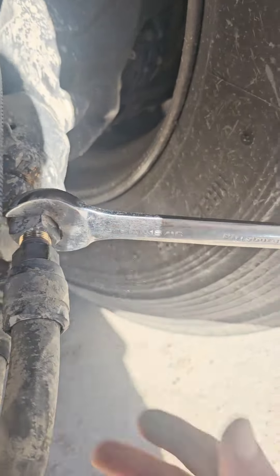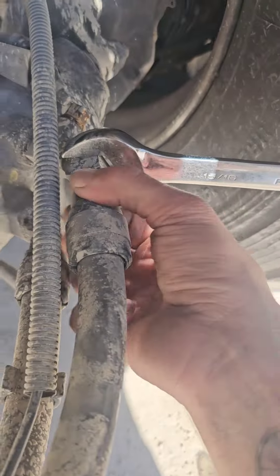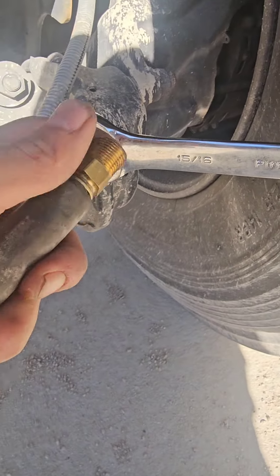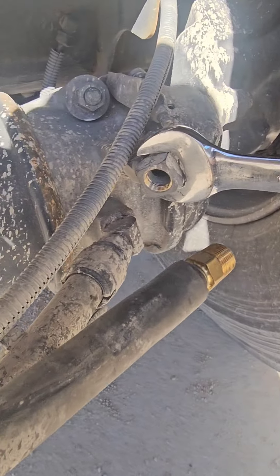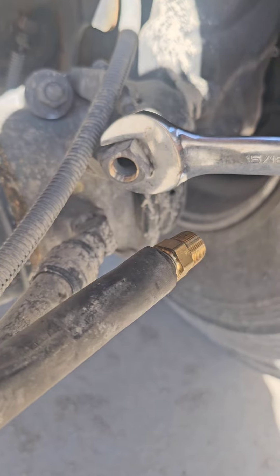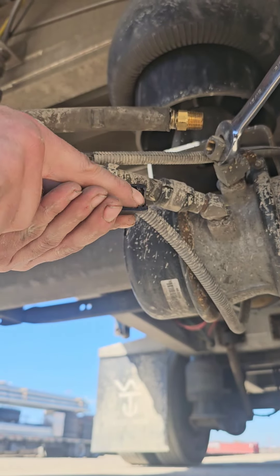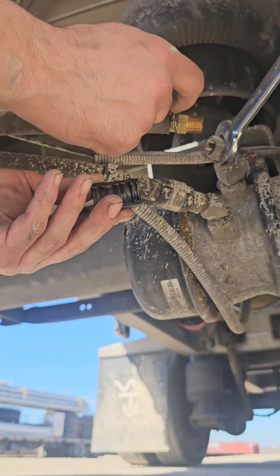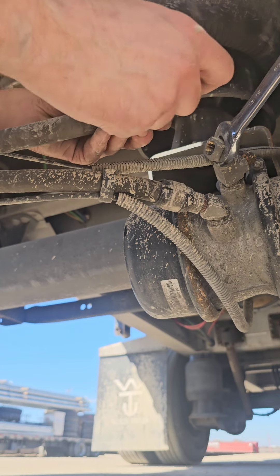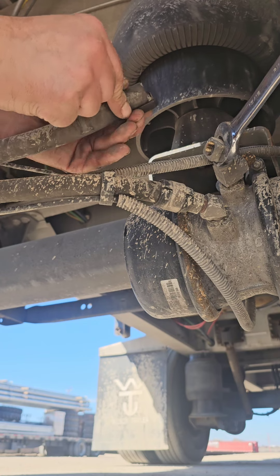To replace the air hose, we're going to use a quick splice fitting. Stick the barbed end into the fitting, put the other two pieces together, and slide a little brass ring on top. You see this smaller groove — it's important that the smaller groove goes into the groove of the fitting, so you want to butt the fitting perfectly up against that.